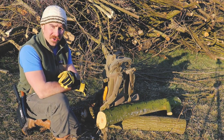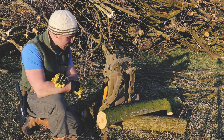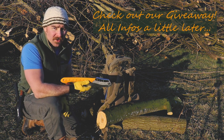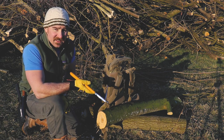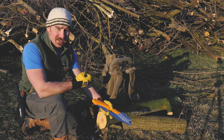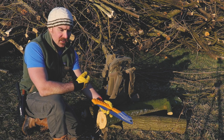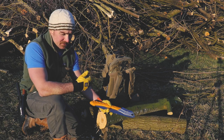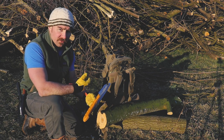When it comes to all-round saws or a Japanese pulling saw you can use for the most different applications, there's nothing better for me personally than the Silky Big Boy. The reason is pretty simple — I've used Gomboys from 18, 24, 27 centimeters, and a Japanese brand called Tajima which is also 240 millimeters. For a little bit more weight that is negligible, I can get a 36 centimeter long blade in the Big Boy.